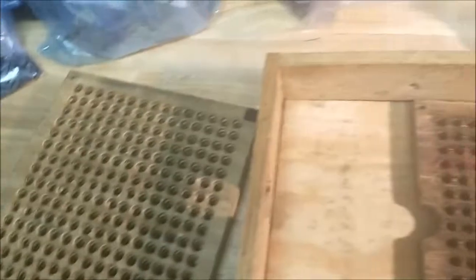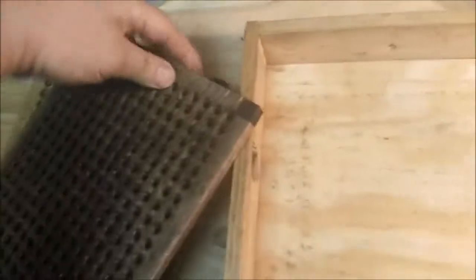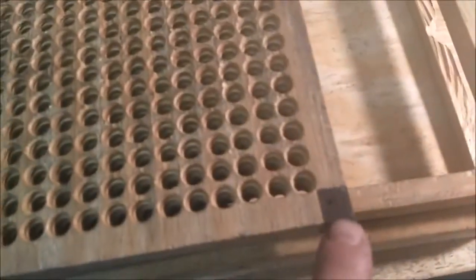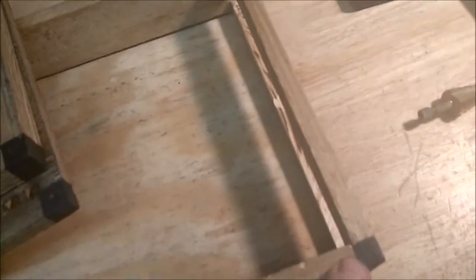And then the center of it is a 1/4 inch hole, and here's the bottom one, and you drill them at the same time. That way all the holes line up. If you're off a little bit, the hole still lines up. And if you see, I marked them so that corner lines up. I built this frame that holds them in place, so all the holes line up. I can slide things around.